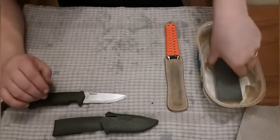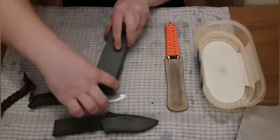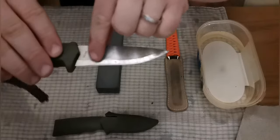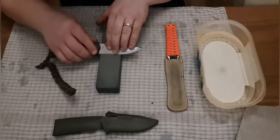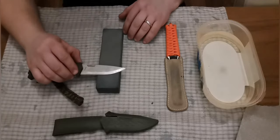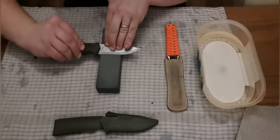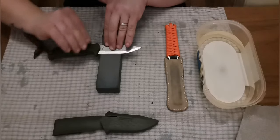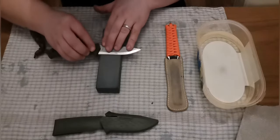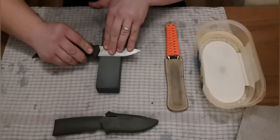So anyway, moving on to actual sharpening. The water stone has soaked up some water. Starting here - you can see the angle, the grind. I may be teaching some people to suck eggs here, but there may be people watching who've never seen how to sharpen a knife before. Stone down flat, that's the knife flat on it, but you just want to tilt the knife forward - see how much that's tilting there? You want to tilt it far enough forward so it's sitting on the angle of the grind, and you just want to push it forward. Not digging the blade in, that'll damage the blade - just enough so you feel it sitting on that angle.